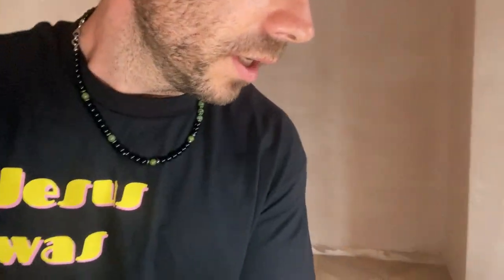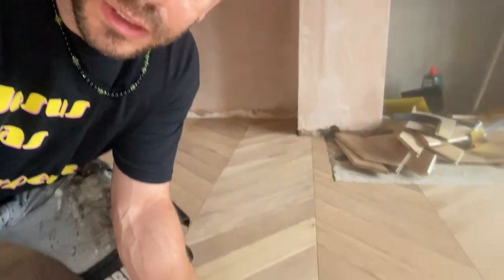Boards are also not perfect. Sometimes there is a bit of a difference, and the edges are curved, or they're missing half a millimetre, or the machine didn't cut the end bit, the groove, properly. So sometimes it gives you a bit of a headache joining them together. I'll give you an example of something I found here. These are the challenges.